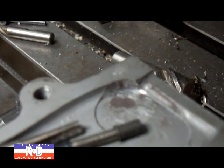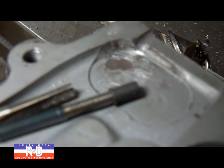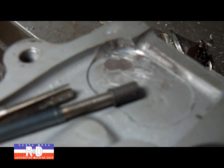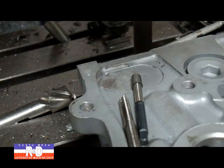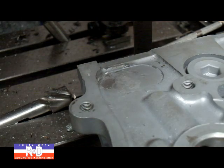We've scraped off the edges a little bit so it'll be easier to work, and now we're going to go ahead and drill and tap for a TimeSert. As you probably noticed, we haven't taken the head off the mill that way we can keep our position.